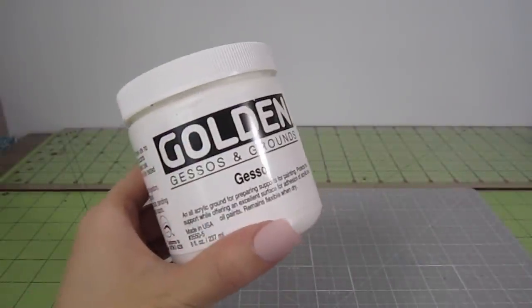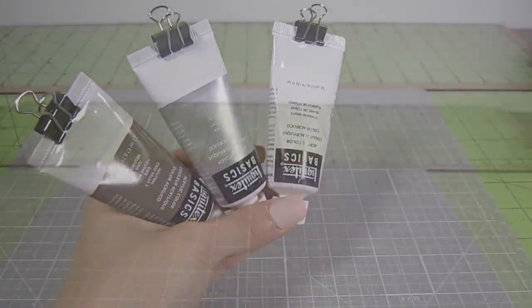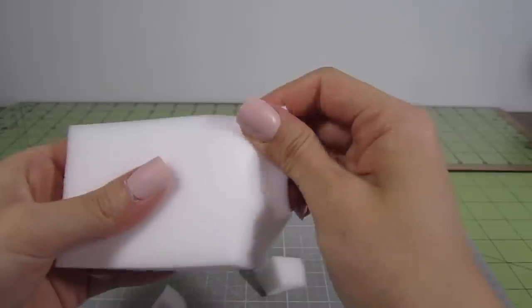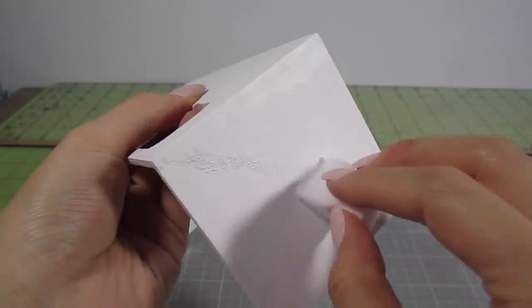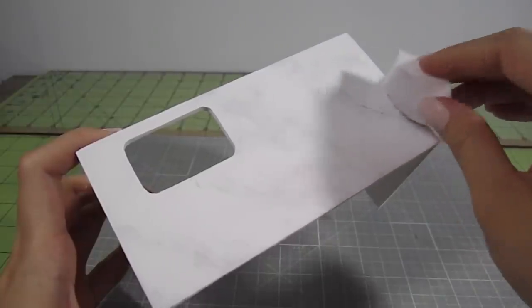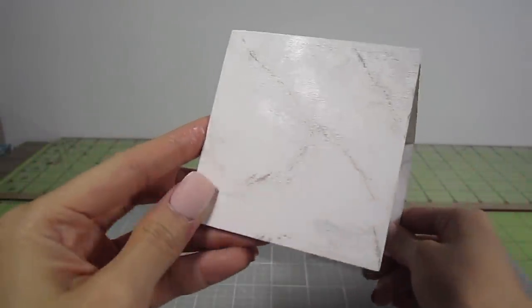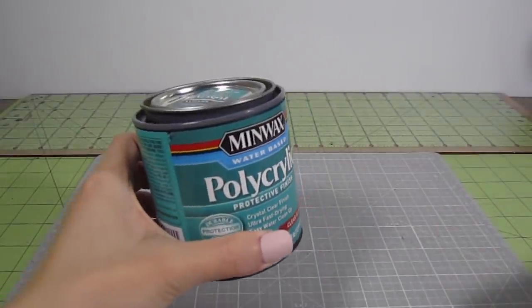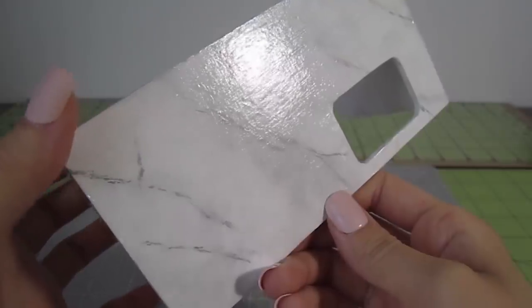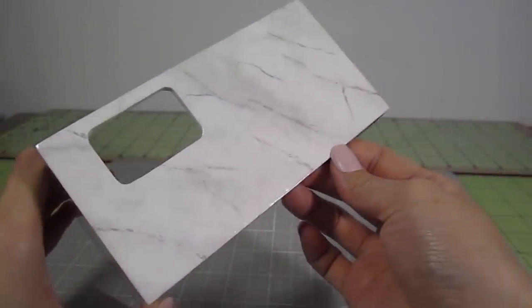Let's get to painting. The first step is to cover the entire piece in gesso. This helps smooth out the wood, hides discoloration, and provides better adhesion for paint. Once that's dry, I go over it with a cold white acrylic paint. For the marbling effect, I'll be using these acrylic paints. To apply the color, rip pieces off a sponge in various sizes. Dab light gray and silver all across the counters. Then for the veining, take a piece of sponge that has a really nice sharp edge. Lightly dab dark gray paint in one direction to create various lines — use a light hand here. For a shiny seal, use polyacrylic water-based varnish. You can also use epoxy or resin for this. If you see any brush strokes after it dries, make sure to sand between coats. I added about 3 coats for this look.